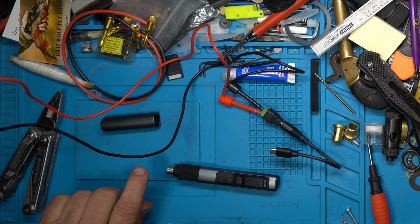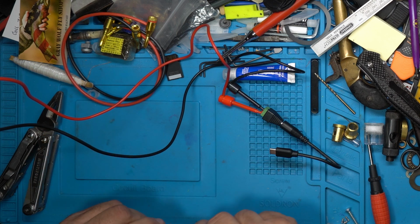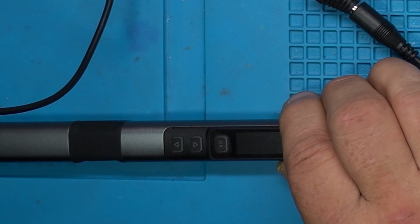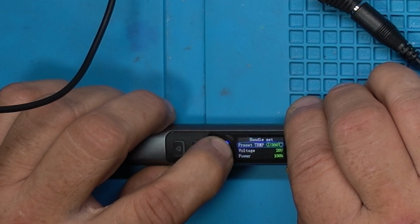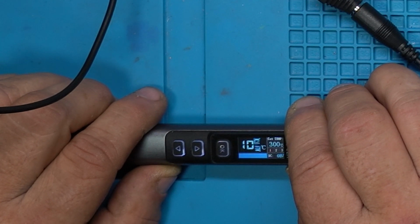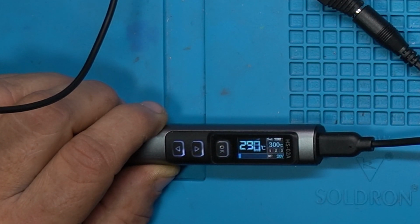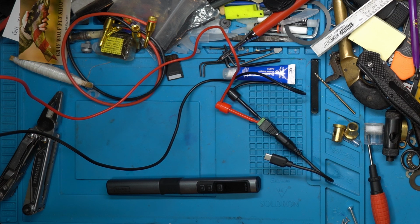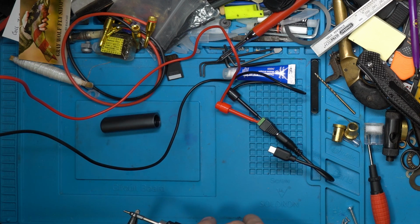Okay, it is cooled down again. Let's plug her in. And again, we got it set at 2.75 amps. Turn channel 1 on. Double check power, 100% power. 2.749 amps, and it's going straight up. So it is right there at the threshold. Okay, fired straight up with no problems. Watching it come up, it was drawing 2.749 amps, and my power supply is set at 2.75 amps.